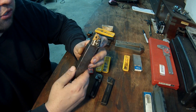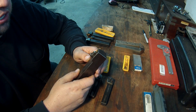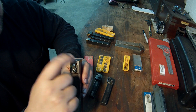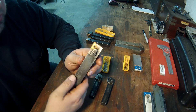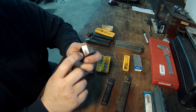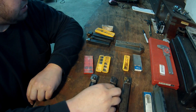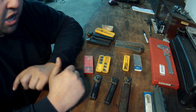The TNMG is another common insert and they're not too expensive. A lot of this is personal preference. The way this particular tool holder is made, it's squared off on one side so you tend to get chips packing up and rubbing on your surface — I didn't like that as much. I've gone in and ground a little relief on this one. But that's the TNMG, and it's pretty much among the most common turning tools I use — and common with other people too.